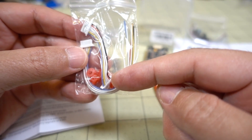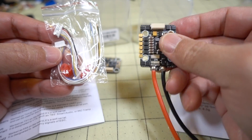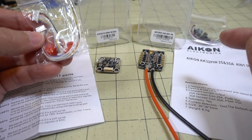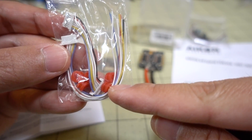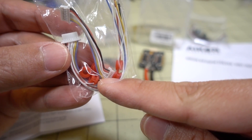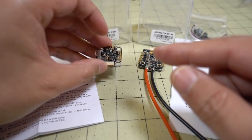You've got a wire harness that goes to the ESC with matching connectors. But if you buy this separately and want to use it with a different ESC, you do have another wiring harness with just bare wires. The flight controller comes with M4 holes, and there are silicon grommets that will convert the M4 holes to M3 holes for vibration dampening.